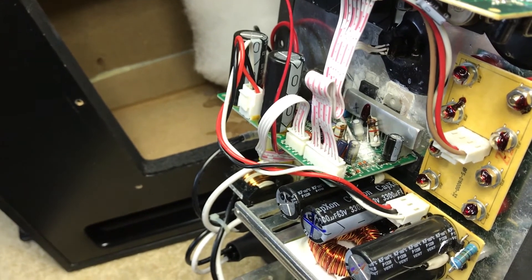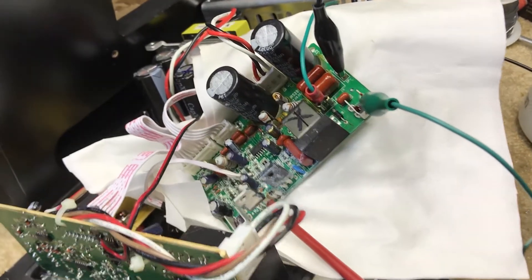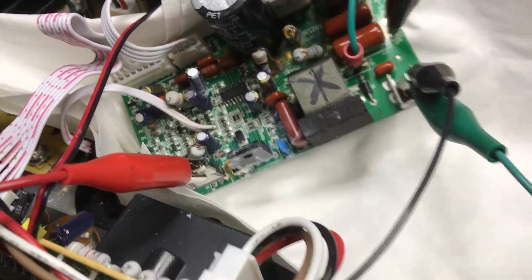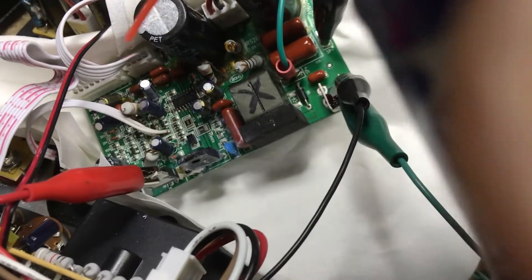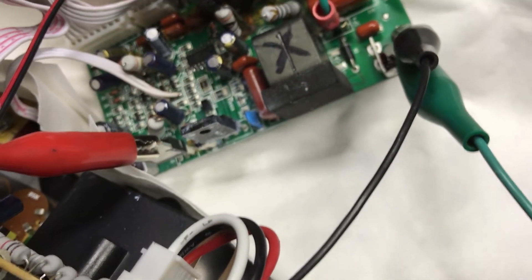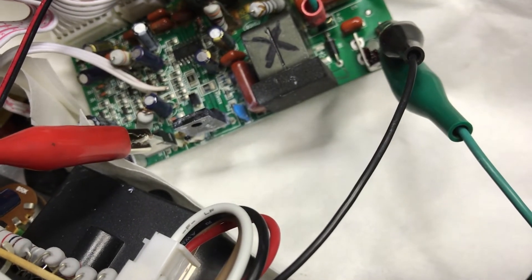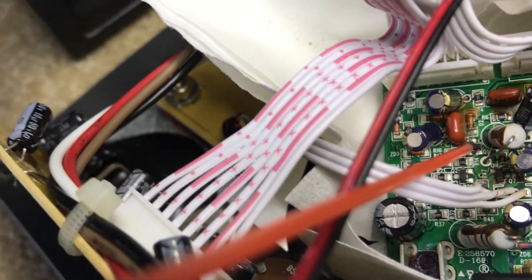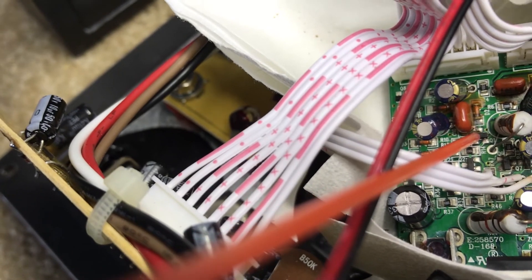Let's narrow that down. Since we'll be troubleshooting live electronics, it's a good time to put on safety glasses. Going back further in the circuit I found one area that's extremely sensitive to the freeze spray — just a little bit in that area. It looks like a ceramic or mylar cap, or perhaps a diode next to it.